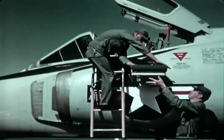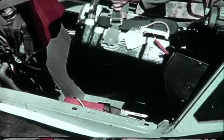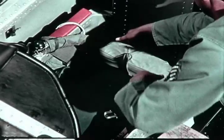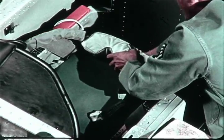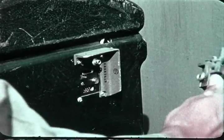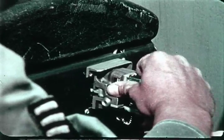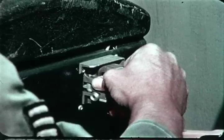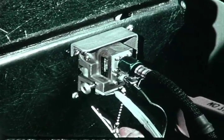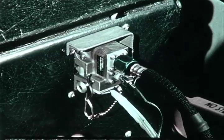Now he lifts the kit into the cockpit and places it on the seat, tilting it up on the forward edge. He pushes the disconnect fitting into the ship-to-kit receptacle underneath the survival kit and removes the safety pin from its temporary position, allowing the thumb button to snap out and engage the fitting. The safety pin is then installed in the hole closest to the thumb button.